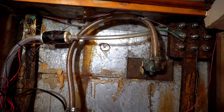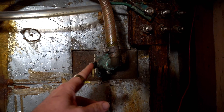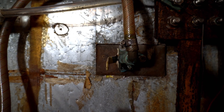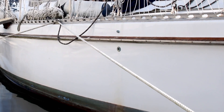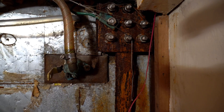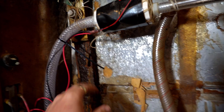This is our chain plate situation, and you can see it's pretty creative in here with some other plumbing. This is actually our shower discharge — when we take a shower, all the water dumps up here nice and high so that when we heel over, this is still out of the water. These little holes are the backing to the rub rail. This other is the vent hose to our toilet. This rusty thing — that's our chain plate. That rusty thing — that's our other chain plate. Here's the stainless steel part you see outside, and it's just bolted to this very, very rusty piece of iron.